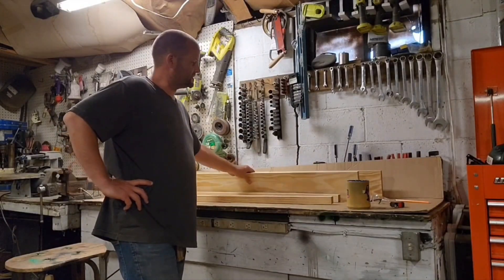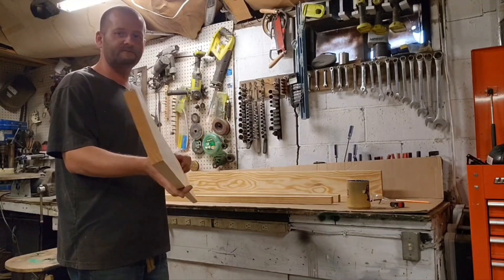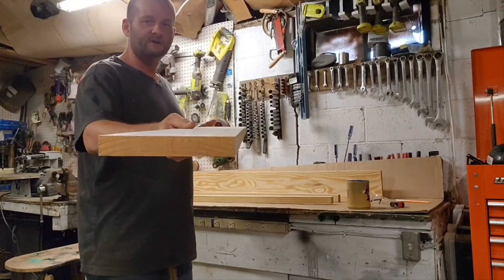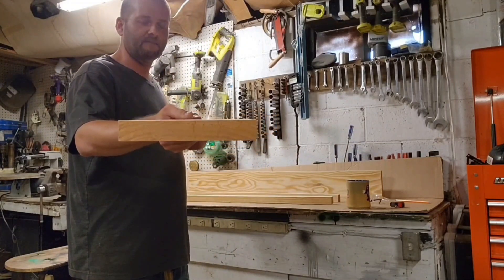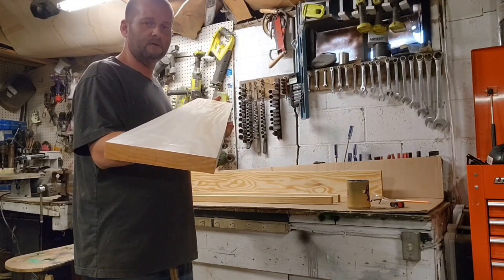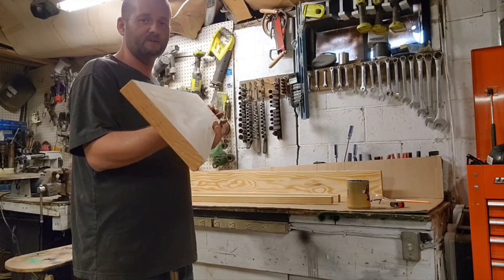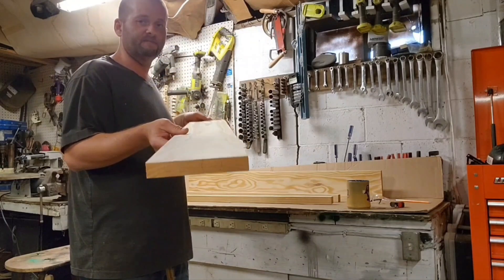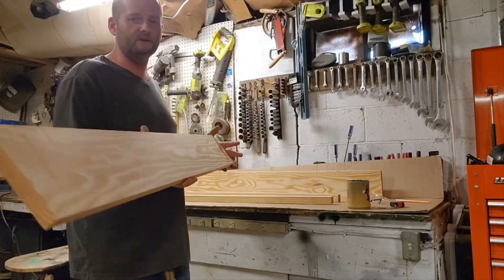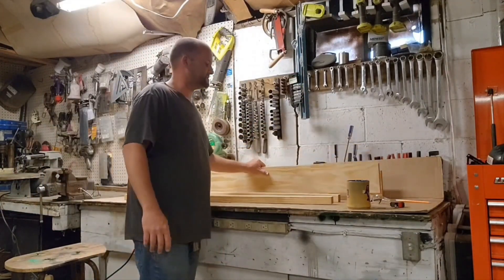When I start off with a good solid plank, I'll go ahead and plane it down to thickness. This is gonna be for my sling bobs — whatever you want to call them. It's already planed down. I take them down to a point eight eight, point eight nine. Point eight nine is nice because for the final sanding it creates a really nice perfect fit for getting inside the slim model Daisies — that's the 105, the 38, the 1938B, 1999 models, the Model 25, all that good stuff.